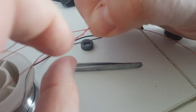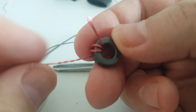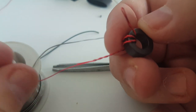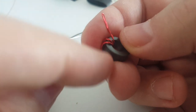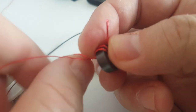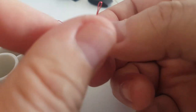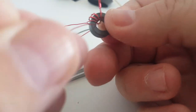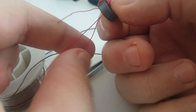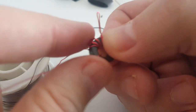Twist them so they're wound around each other, not just one around the other. It doesn't have to be precise. On a toroid, we count the turns on the inside — so one, two, three turns for the primary. Then I'll continue spooling, untwisting the tap wire which will go to the center of the BNC on the PCB, and continue winding the secondary until I reach 24 turns total. And now we have 24 turns.